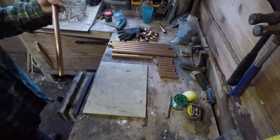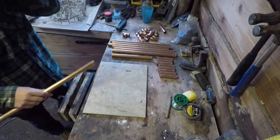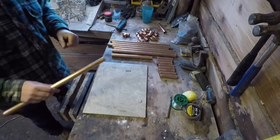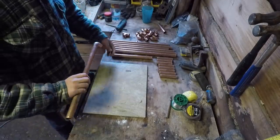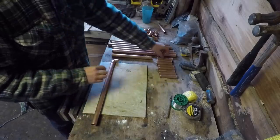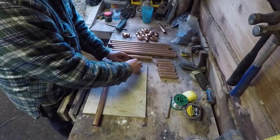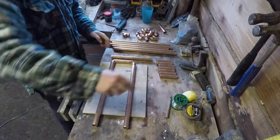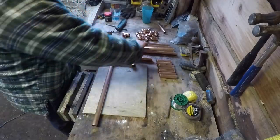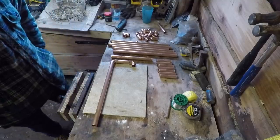So I'll put a T with a drainage cock on the bottom. Right then, I've got all my parts cut, all the different parts for the heat exchanging coil. So next job is to start soldering. They're going to be in a bat-like fashion, zigzagging up. So we just solder some bits at a time, and do sections like that.